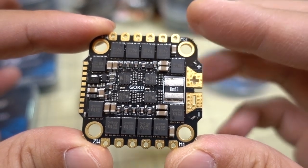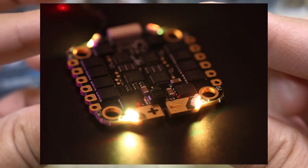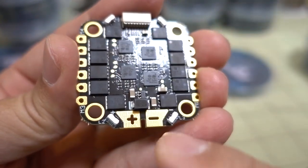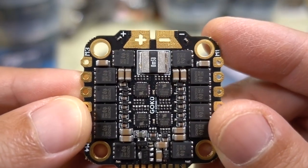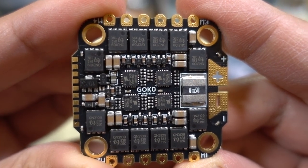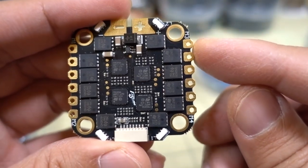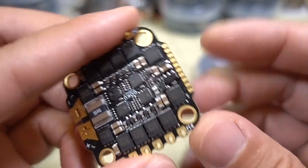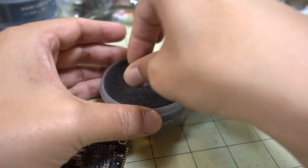It will burst to 55 amps for 10 seconds. There are some LEDs here in the corners that will light up as your motor output changes - I'm not exactly sure how they're programmed, but it doesn't look like they're programmed through Betaflight OSD. Very big pads here for your battery connection, and you can stick your capacitor through there as well. Got your current shunt here on the bottom, and the FETs are pretty big, so this should handle plenty of power. There are through holes on both sides so you can solder motor wires from either side. You have a plug to connect to your flight controller, or you have solder pads here, though they're not silkscreened, so you'll have to refer to their online instruction manual or diagram.